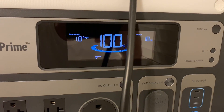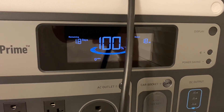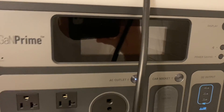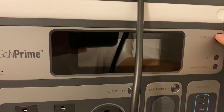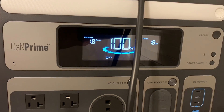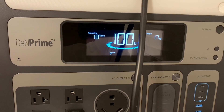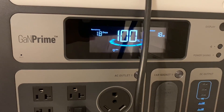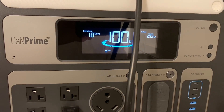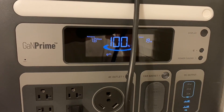I do know from before when I ran it for 12 hours I averaged 150 watt-hours, and I had 17% of the battery left on the power station. But this time we're going to have the sun coming up in the morning, which will start giving us more power. So with 300 watts we're going to see how long we can run this — I know I'll get 12 hours tonight, and then we'll see what happens tomorrow once the sun comes up. See if we can get 24 hours out of it; see if we can make it to nine o'clock tomorrow night — that's my goal.